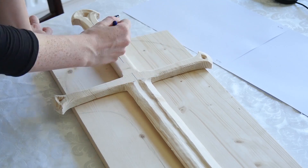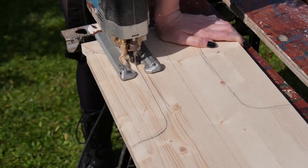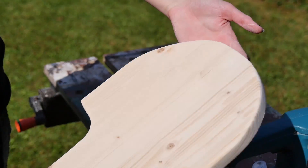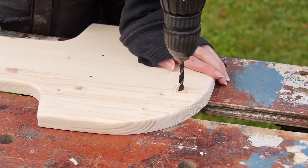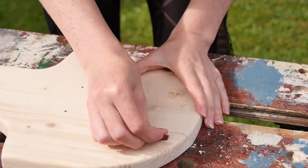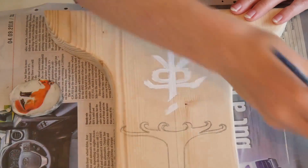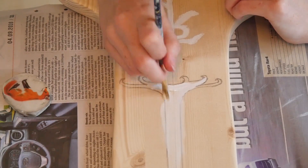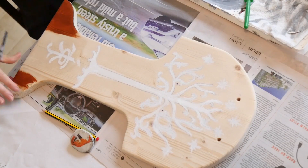Now onto the mount. I sketched the rough shape I wanted and then made a half stencil for that and lined it out. I cut it out on the jigsaw, then clamped it in my workbench and smoothed down all the edges with a sander. I only really rounded off the edges on one side because that's the way the mount will be facing. Next I marked out where the holes are going to go — the top two are so that the mount will sit flat on the wall, and the other two are pilot holes for the screws that will hold the sword. I cleaned up those holes with some sandpaper, then onto painting. I drew out my pattern onto the mount — I knew I wanted the Tree of Gondor — and I picked the entire shape of the mount based around that, but you can have it any shape you want and it'll still look fine.